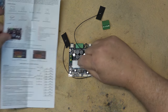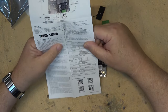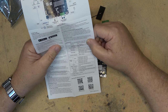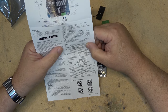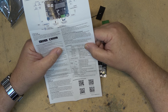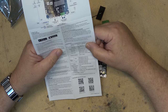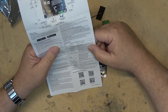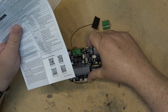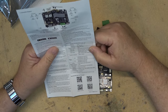That will double your output power from the amplifier. Looking at specifications: it's got 802.11 b/g/n 2.4 gigahertz, a single 10/100 RJ45 port, supports Bluetooth 5.0, SBC, AAC, host mode USB music, and Bluetooth distance is 10 meters — about 33 feet. Power input is 12 to 24 volts through the power input connector.